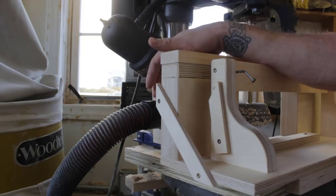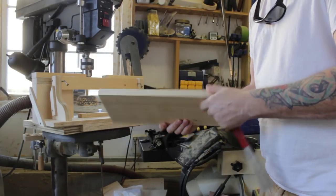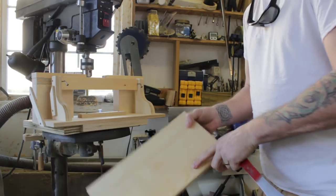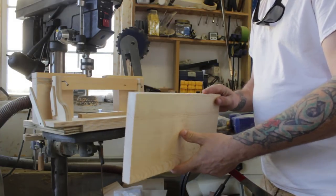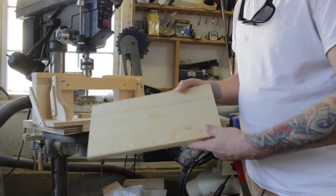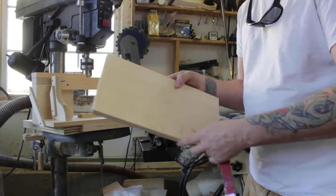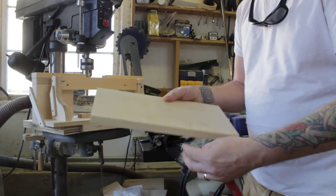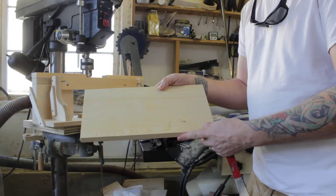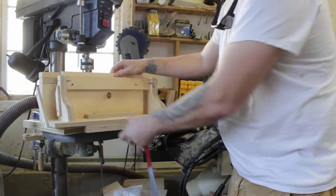What I've got here is a piece of three-quarter stock. The inside dimension of the jig is a little bit larger than that, so I think it'll take up to probably seven-eighths stock without any modification. This is thirteen and three-quarters wide and six and five-eighths tall, which is the standard size for an eight-frame length shallow - Illinois honey super - is what you would technically call it. Let's go ahead and cut a handle on this. All we have to do is drop our wood in like so.